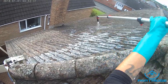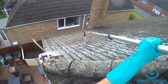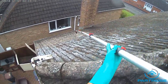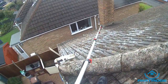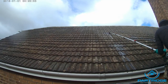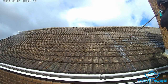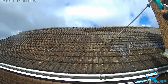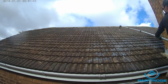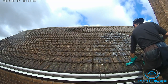Make sure you're letting your customers know this is a long process — it's not an instant clean like bleach. It's a long process but a lot safer on the roof, and it's all biodegradable so it won't be harming anything. The only thing I would say is be very careful if there are plants and foliage around — any runoff, you do not want this stuff on plants because it will kill them. If you do get any on plants, spray them down with water, preferably beforehand before you clean the roof, and afterwards as well.